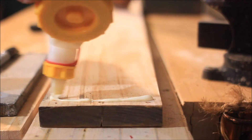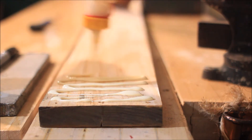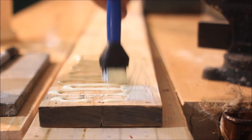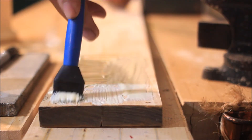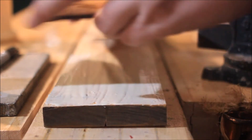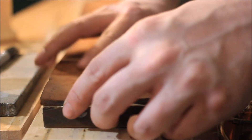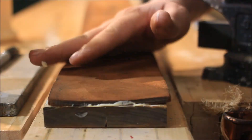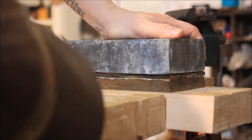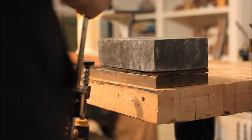And speaking of that leather lamination, let's get started on that. A healthy helping of glue, which always looks good on-screen — spread nice and thin and evenly over the entire section that's going to be glued up. Place the leather. I'm doing this in sections because I didn't really have the capability to do the whole glue-up at once. It takes extreme pressure. You can see this 30-pound brick still doesn't have enough weight to keep it from curling up at the edges, so I had to add clamps as well.